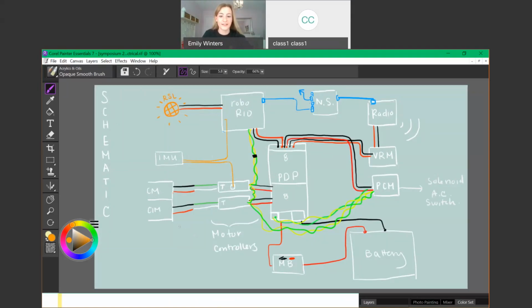Something else that can help with the robot's positioning is called an encoder. Just imagine we have the shaft that these motors are running. We're just going to place the encoder on that shaft. I'll write it out. So these motors are ultimately using a gearbox to turn the same shaft, and this encoder will be on that shaft in some way or form. And so it counts a number of ticks per revolution. So let's say, for an example, one revolution was 4,000 ticks, or 40,000, I forget, on the encoder. So it knows how much the motors are turning on each side of the drivetrain.